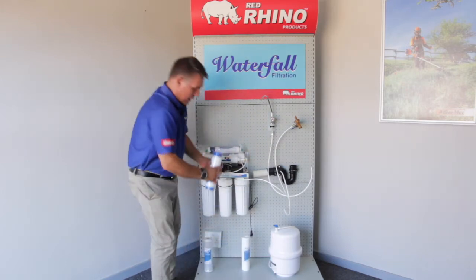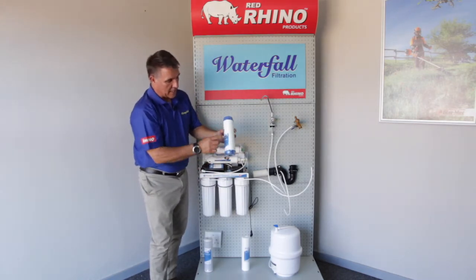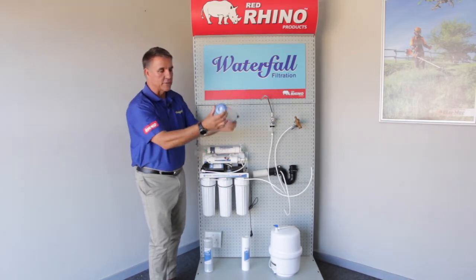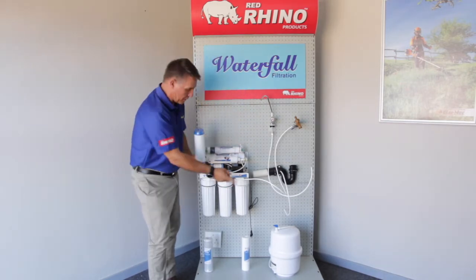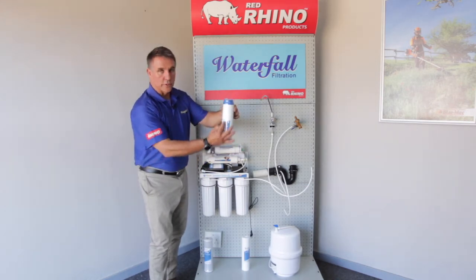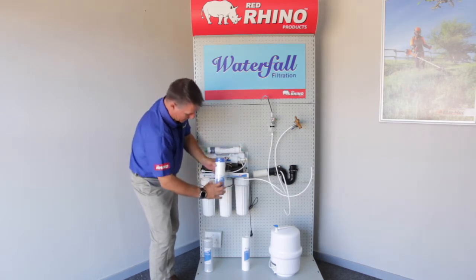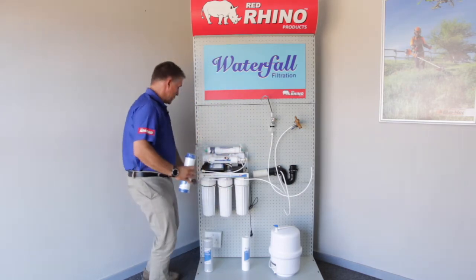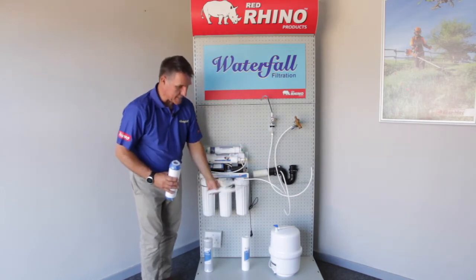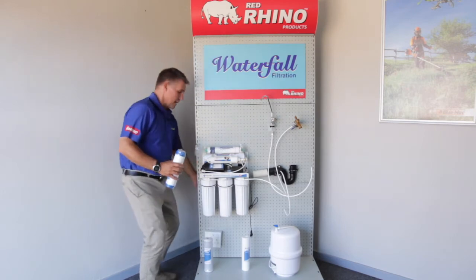Your second one — inside the casing, take the plastic off. It has an 'up' sign, so make sure you install it correctly. If you install it upside down, this will block the flow of water and you'll think your system's not working — that's not true. Make sure you're inserting the filter correctly. Unscrew it, drop it in this way because it must be pointing up, tighten it. You've got a spanner to tighten your casings — don't over-tighten, make sure they're nice and secure.